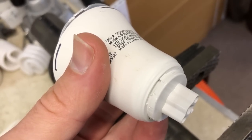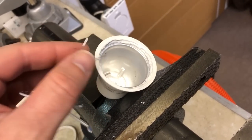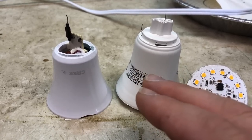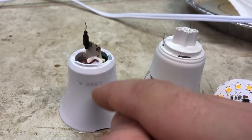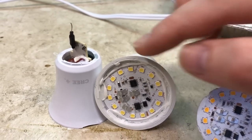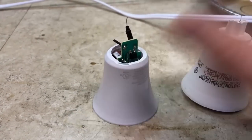For reference, here's the EcoSmart base — the metal part comes off the plastic easily and the wires inside aren't soldered to anything; they just feed through holes in the bottom, and the top plate peels off with a screwdriver. Comparing the two bases side-by-side, the Cree's circuit board that controls the LEDs is up inside the heat sink, while on the EcoSmart all the electronic components are mounted to the circuit board itself. On the Cree, only the diodes are on the circuit board, which allows for better thermal control.